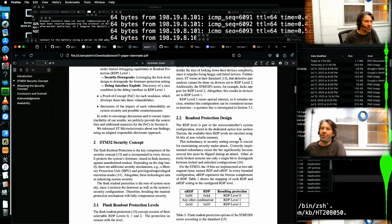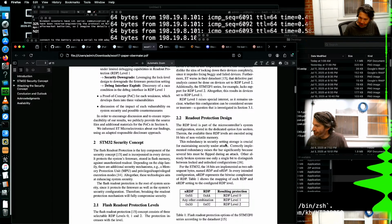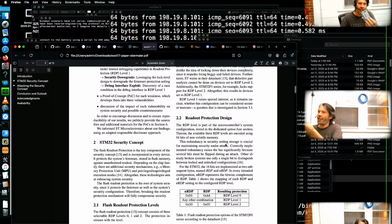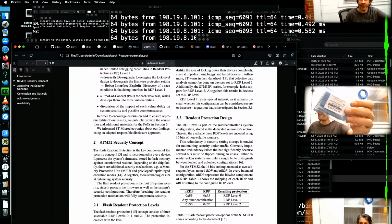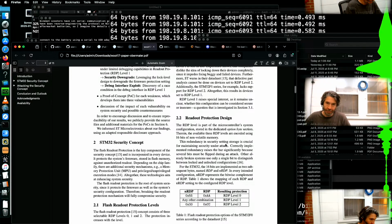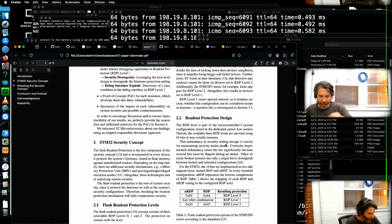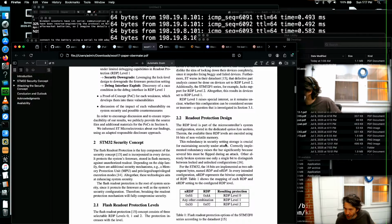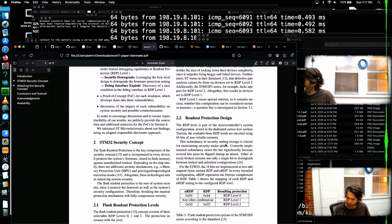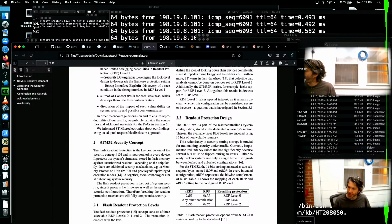But as I mentioned, there's supposed to be a security function in those controllers. Originally, they started out as, I believe, essentially an nRF51822. That's a Nordic chip. You might remember it from the nRF24L01 series. That was what they used in the CrazyRadio for that drone project. It was used in the MouseJack exploit. It's used in a lot of wireless keyboards and such.